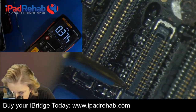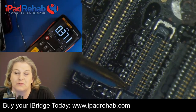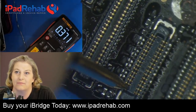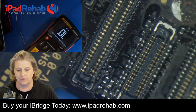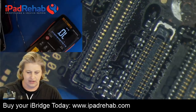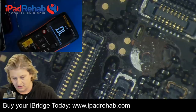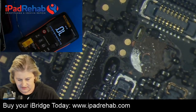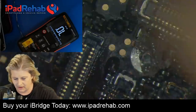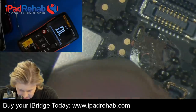All right, let's go back in this connector and see what the result is. Now at pin 29, I am back at my normal diode mode reading, which means I should be able to get 1.8 volts on that. Let's see if I can. The next thing I want to try is to put back on the iBridge and see if we can actually fire up the screen this way.